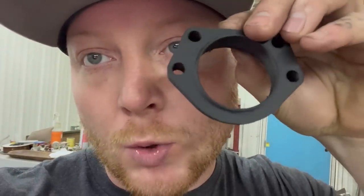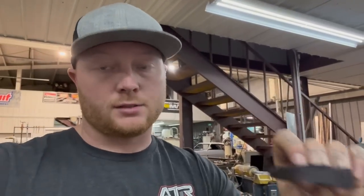A couple of things to cover about what I did when I printed these out of carbon. That is ColorFab XT-CF20 carbon filament — it's sold on Prusa's website. I did have to get the upgraded hardened steel nozzle to print this because you have to run it hotter. I run the Prusa Slicer — you design something in Fusion, click 'make,' and then select your 3D printer. It puts your design on a virtual print bed where you can select settings. The Prusa Slicer has almost every kind of filament and nozzle option you want.